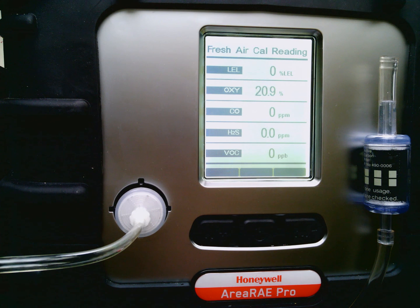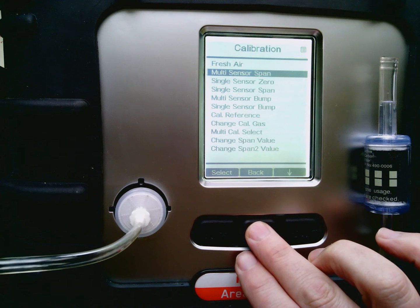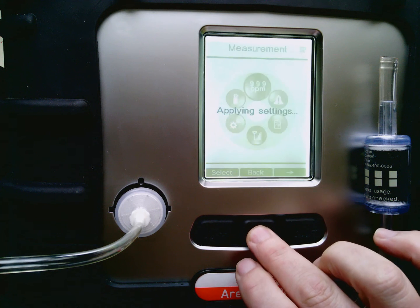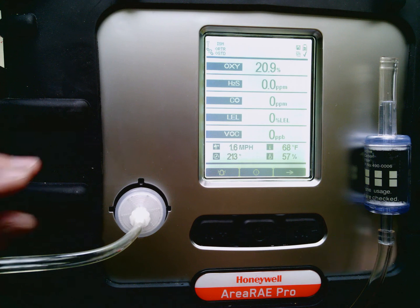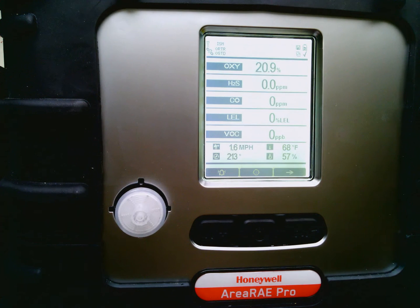You can notice that PPB actually says zero right now. I'm going to go back and show you what I'm referring to in fresh air. I'm going to hit the soft key back button, and back one more time, and it's going to apply settings — and you'll notice that the PPB reading is actually zero. So I'm going to take off my zero vapor scrubber, and what we should get in a second once it starts registering is some actual PPB readings. You can see it's starting to climb up a little bit. That would be the true way to do a fresh air calibration to a PPB sensor.